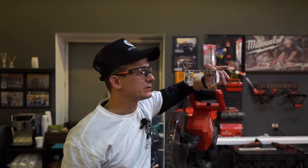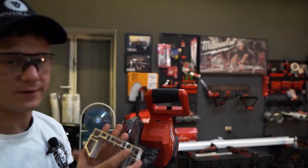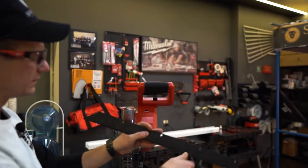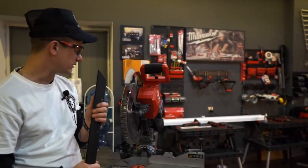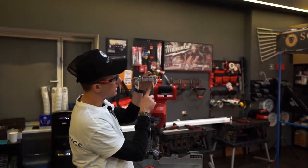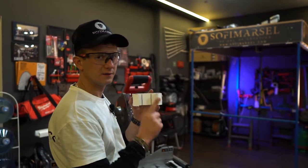If you want to mount our curtain profile 094 gapless close to the wall, you need to work the same way as when you realize a multi-level stretch ceiling. Make a 45-degree cut in the wall mounting profile — in our situation this is the 0-112 shadow profile. The main thing you need to know is that if you want your curtain to look nice, you need to make a little pre-cut on the thickness of the wall mounted profile, but this part of the profile does not need to be cut.